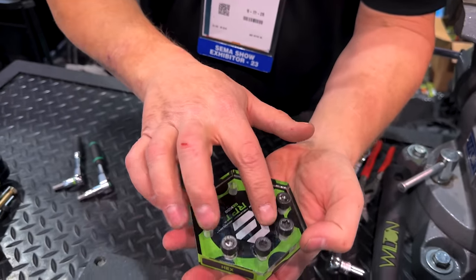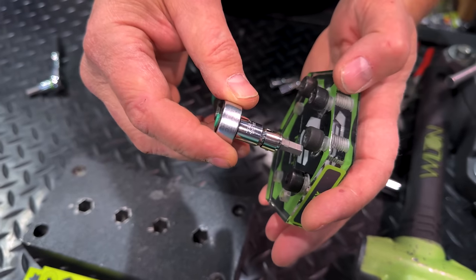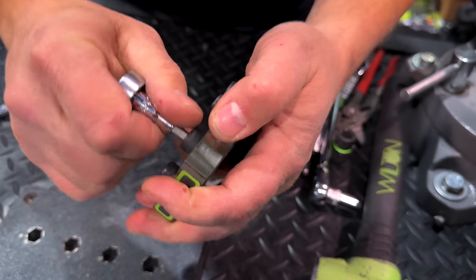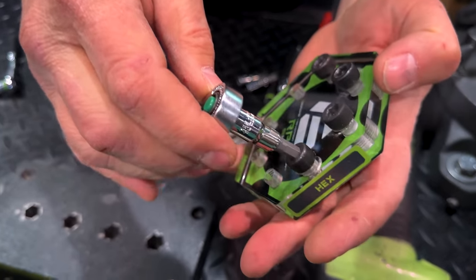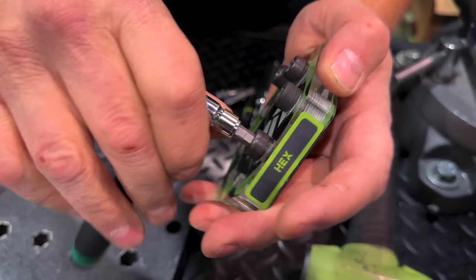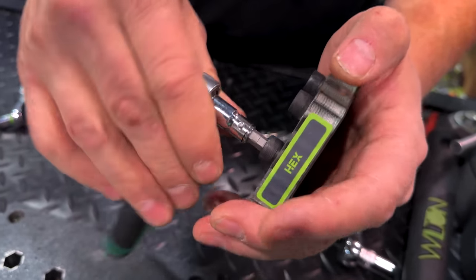In the demo block, I've got a good hex fastener and one that's been rounded out significantly. I've got a regular 6mm hex to show that when you insert it into the good one and crack it loose, it works just fine — it'll tighten back down just like it should. When we insert it into the damaged one, there's absolutely no engagement whatsoever. You can hear it clicking because all that pressure is being exerted to the outside corners — that's why they round over.